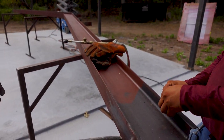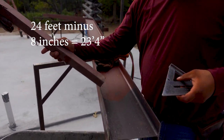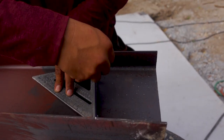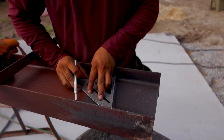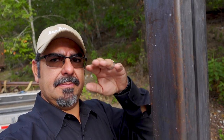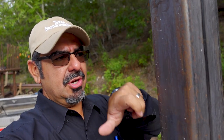You need to do edge to edge — 24 feet minus 8. Why minus 8? Because the I-beam sits on the inside of the tubing and that tubing is 4 inches on each side. Right now he's marking the pitch — we are doing a 3-on-12 pitch, so do not cut this at 90 degrees. They cut the I-beam 8 inches shorter because the tubing is 4 inches on each side, that's 8 inches total. The I-beam is gonna sit on the inside, but only the web and the bottom sit on the inside. The top is gonna stick all the way past and sit on top of the tubing. The bottom is on the inside with the web, and they cut that hook — they cut a groove or notch on the tubing and that's where the I-beam falls into.